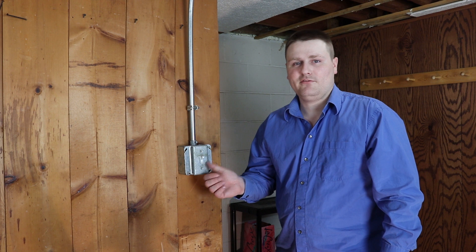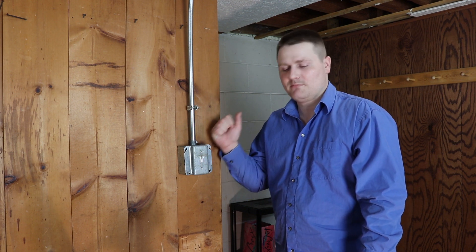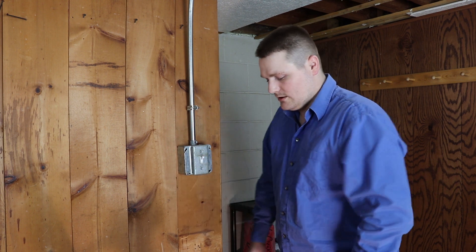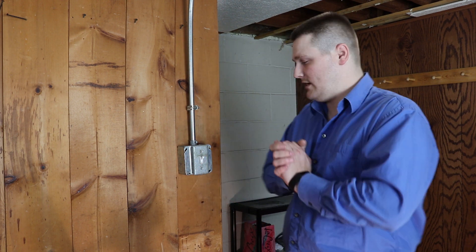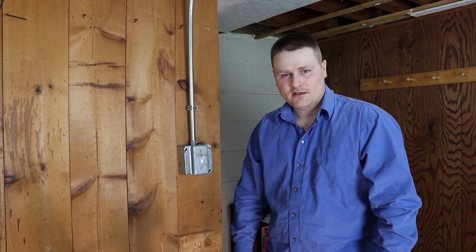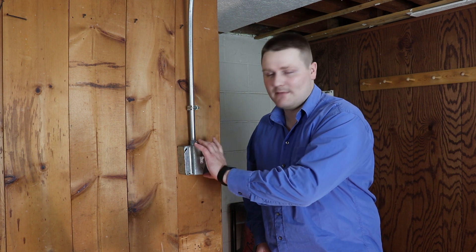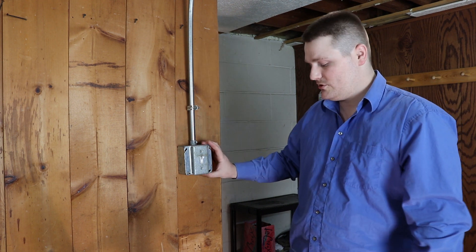So first I'm going to take this cover off and test to see which is the hot and which is just the line going to the other lights. I already have a neutral set up in here because I was doing some stuff — it's taped. What you would do is add another wire nut or a bigger wire nut or push-in wire nuts so you could get another neutral, because the switch does require a neutral line. There's some modifications you can do without a neutral, but this install there is going to be a neutral line.